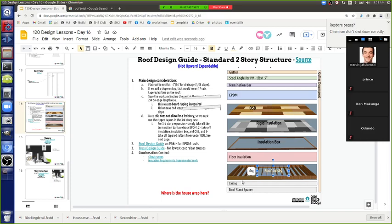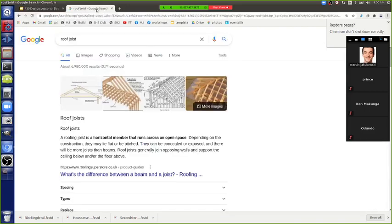But a 16-foot joist, if you put it at an angle, will be shorter. It won't span the whole distance. Should we make them longer? No, you don't want to, because if you look at the detail, it's minimal. It's like 0.1 or 0.2 inch. Very small, because the angle is super low. It's almost a flat roof. When you put it just 1 degree up, you can hardly see the length difference. That's the geometry of it.